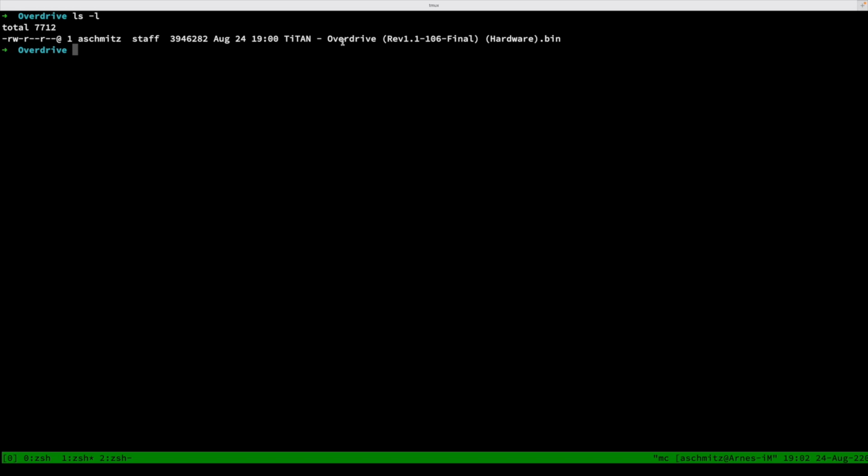Well, actually, it doesn't matter when we byte swap this, but yeah, the output needs to be byte swapped anyway, which means every other byte has to be swapped with its predecessor, because the Motorola uses a different endian encoding for 16-bit values, basically, than the Intel processors like the 8086 does.